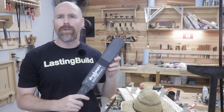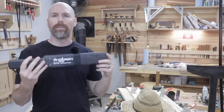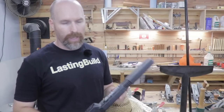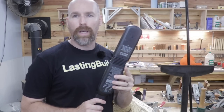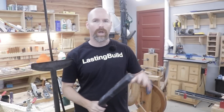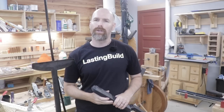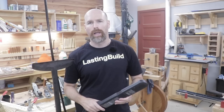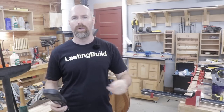The fourth tip is to make sure you have a good metal detector. I'm using the Wizard 5 metal detector I bought on Amazon — I'll put a link in the description. These pallets are riddled with nails, and I've even found small fragments of metal I couldn't see with the naked eye. One viewer mentioned that he drills out nail holes because the small metal wires that connect nails inside a nail gun can get embedded in the wood and damage your planer. On multiple occasions I've detected metal with the detector that was completely invisible to the naked eye.